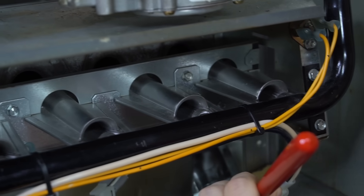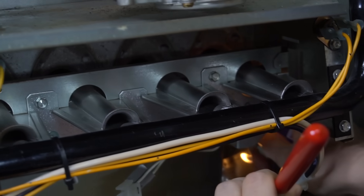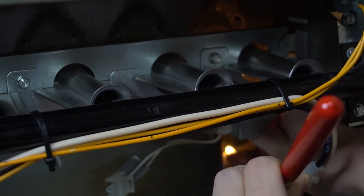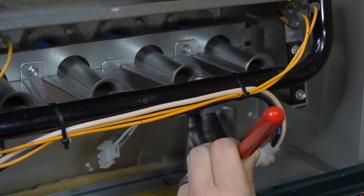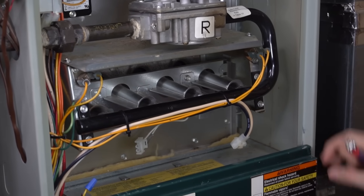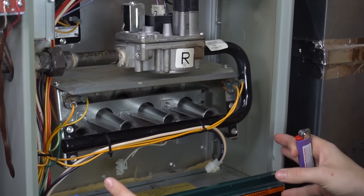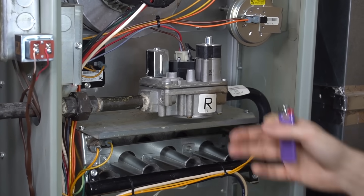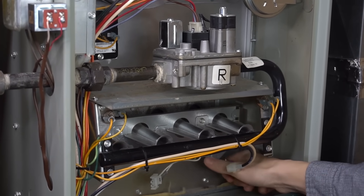So I'm going to turn the power back on and light this thing with a lighter. I'm looking at the front of the burner so I know where to aim — it has to be really close to that front burner otherwise it's not going to light. The gas valve should be opening soon... and bam, it lit very smoothly! Basically, when that gas valve opens up you want to have the light already there. You can first turn the power on to count how long it takes for the gas valve to open, then reset and time it so you know when to put the flame there.